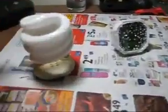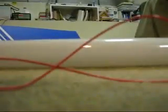Here's the bulb part itself. 4 wires, 2 going to each electrode. Okay, so here's now the test. I connected some wires to it and ran it to this 2-footer. So all I have to do is plug in the light socket and hopefully it'll work. And it does still work, huh? No flicker since this is an instant start, but it'll do.